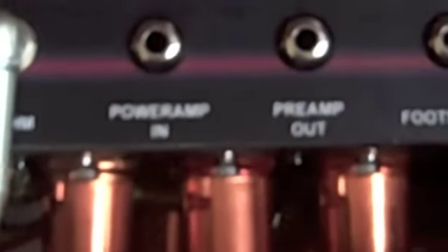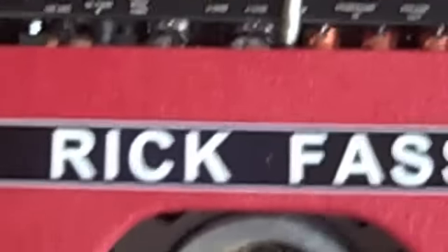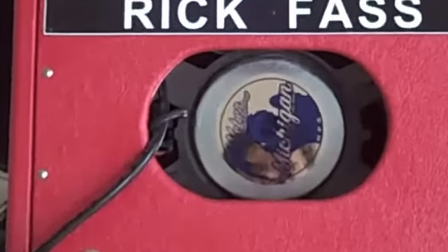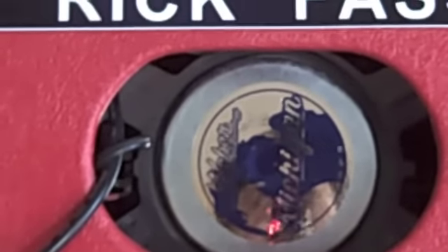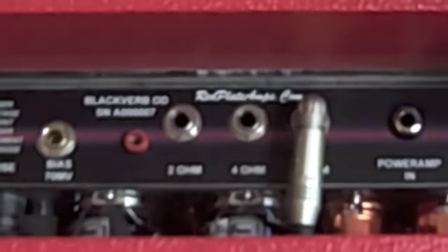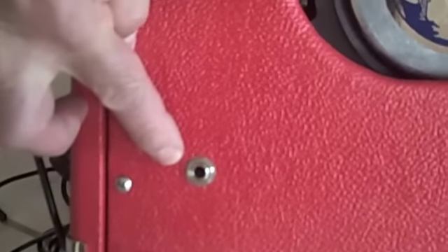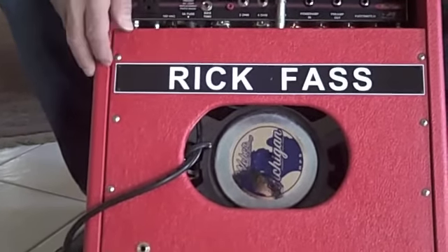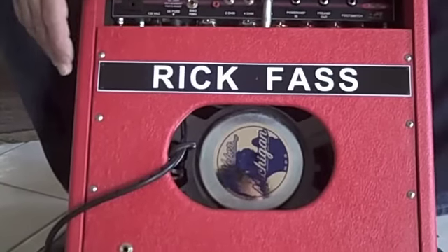The preamp out is a great feature for recording or if you're using live PA and need to go right into the board — it's killer. Henry, being a guitar player, realized that on occasion you might want to use another cabinet. So he made it easy to accommodate a two-ohm, four-ohm, or eight-ohm load. The only downside of adding another cabinet would normally be needing a Y jack, but Henry's ingenious — he put the output jack right here so they're paralleled. All you need to do is go from the cabinet back into this one, change the impedance, and you're done. It's so simple and I don't know why other people don't do it, but maybe that's what makes Henry unique.